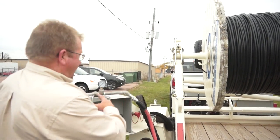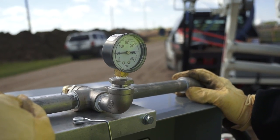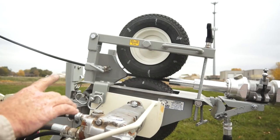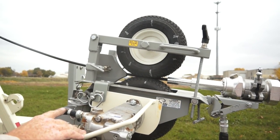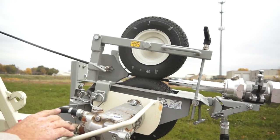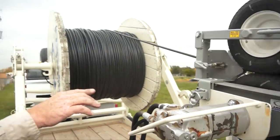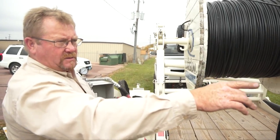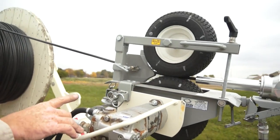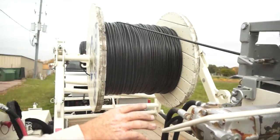First thing we do is add air, trying to get our air pressure up to about 50 pounds. Then we turn the tires on and look for the rotation of the tires. You can see the pencil marks on there. We start going slow, get the cable feeding through, and as we get going we add a little more air. We continue to speed up the tires, add a little more air, and a little more tire until we get a nice speed going. You're watching your markers and you can just pick your speed.